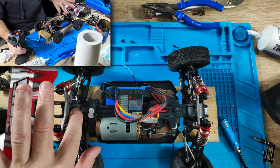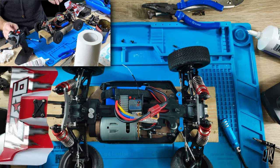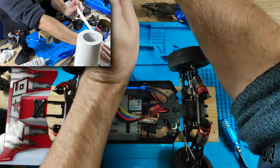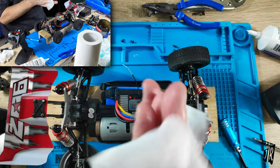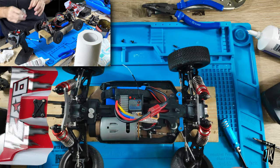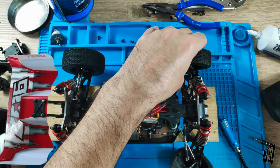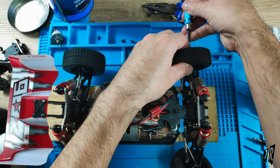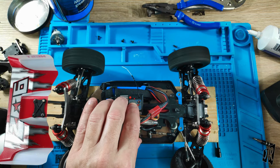Okay, I think it just needed the grease to get in the places that it needed to get into, because as you saw, once they get up to speed, my hands are so greasy right now, once they get up to speed, the white lithium grease is running further than the other side. So keep an eye on this one versus this one. Really loose. Okay, I'm going to leave it really loose. Right. Full speed.